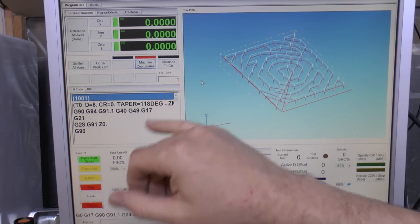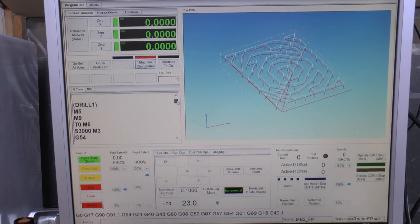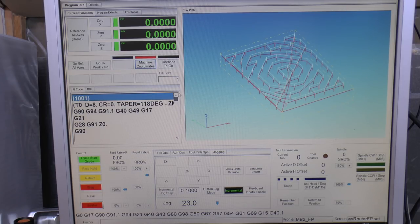You can see the program in here — this was actually created in Fusion 360. I haven't done a video on that but if you want to see how it was done then put a comment in the description. So essentially there's the drilling operation, and then all of the various coordinates that we'll be drilling at. As you can see they are all in multiples of 80mm, the first one of course being at zero. Quite a short program there, nothing really too surprising in that.